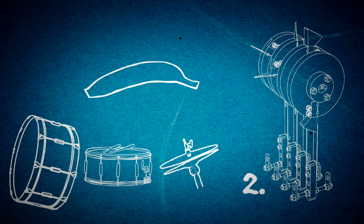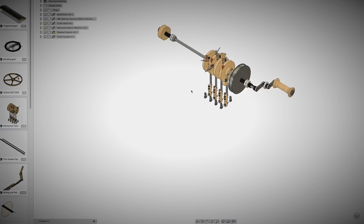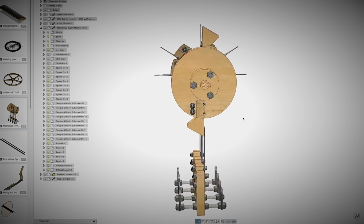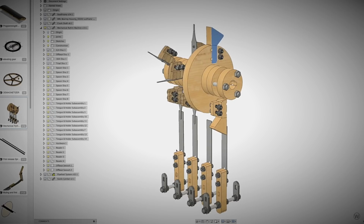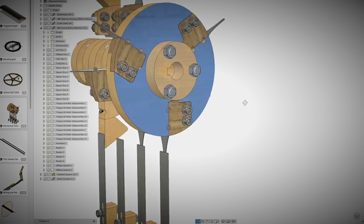This mechanical rhythm machine is the shaker of the Marble Machine X. So it's situated on the crankshaft and it has 4 different discs. One disc plays the first stroke of each bar. One disc plays the offbeat. One disc plays 16th. One disc plays triplet.